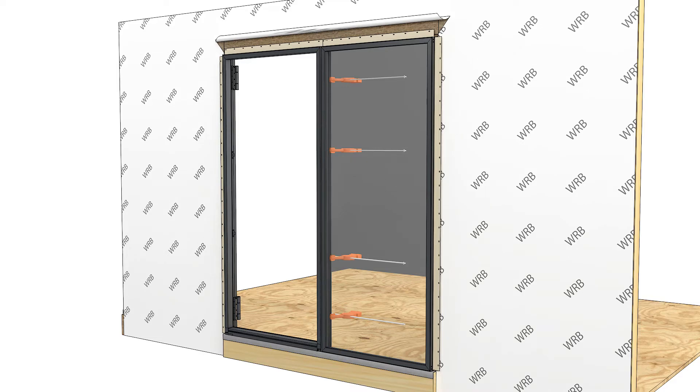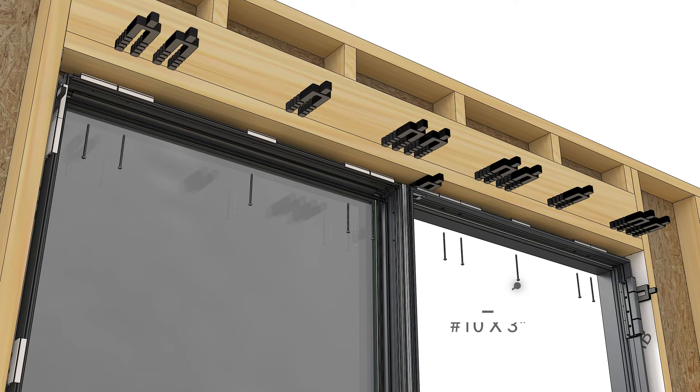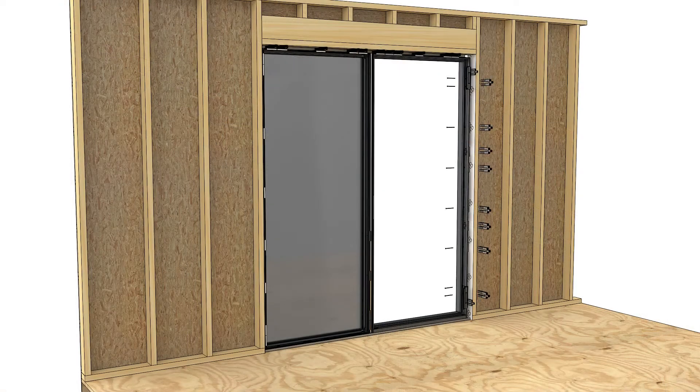Repeat the previous steps until the assembly is complete. Make sure all the frames are aligned along the correct exterior plane. Fasten the head jambs with number ten by three inch T20 Torx pan head installation screws. Complete fastening around the perimeter at the remaining installation holes. Maintain a square and plumb installation and shim at every fastener location between the frame and the rough opening.